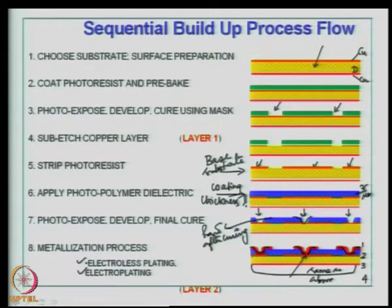After plating, you can image the layer according to your circuit design. This is a very convenient process where you can inspect at every stage. In contrast, with a multilayer board, once inner layers are pressed together, it is very difficult to repair registration or plating problems in mechanically drilled through holes — you have to discard the board. But here, at every stage, you can inspect, rework on the layer, and then build additional layers.